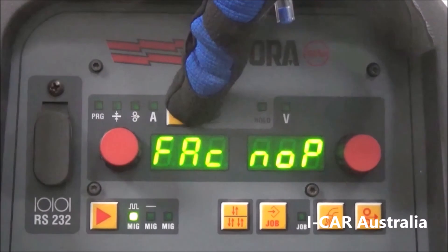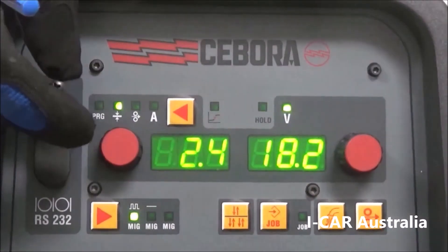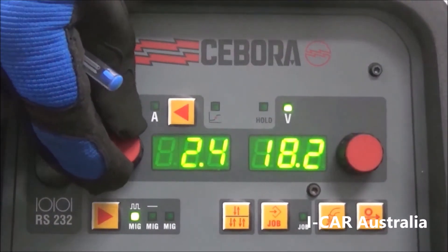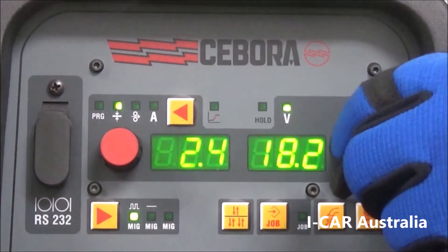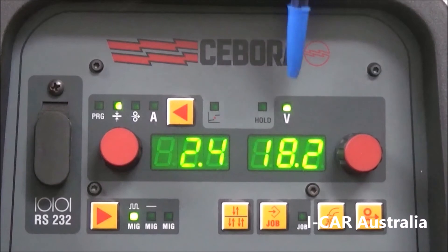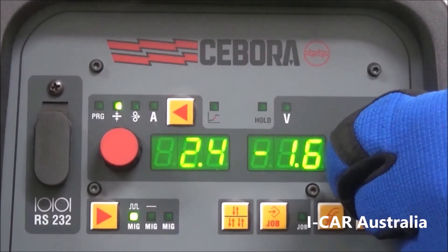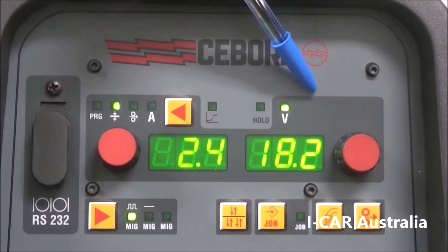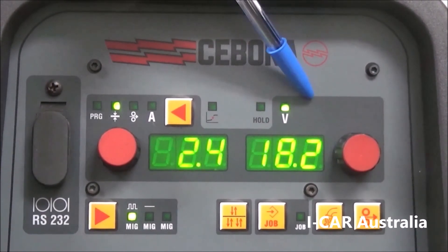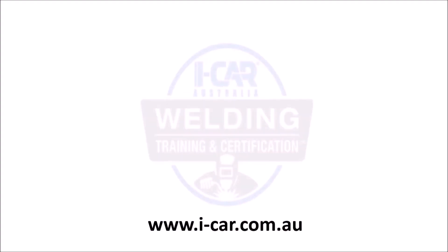Using the arrow, we come back to our main selection for our welding methods. The dial on the left is your metal thickness setting. The dial on the right is your arc length setting, currently showing voltage — touch it and it adjusts your arc length. When you've finished your practice weld, always look at the screen as this will tell you what voltage you finished on. Around 17.2 to 17.5 volts is pretty much where you want to be when you finish your weld.